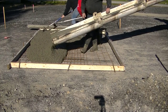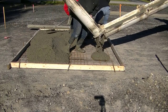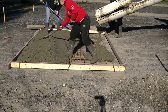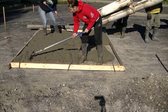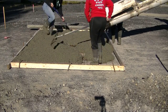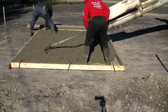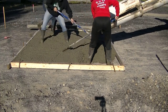This is an 8x12 concrete slab that the owners are going to buy one of those pre-made sheds and set it on top. The shed people usually fasten it down with some Tapcon screws or something. We got it formed up and we got the wire mesh in it for reinforcement. We're using a 3,000 PSI concrete mix. If you want to know how to form up a slab like this and get it perfectly level and square, you can check out my concrete slab course down below in the description. This will give you a pretty good idea how to pour it and how to finish it.